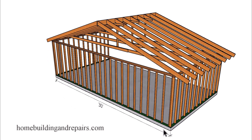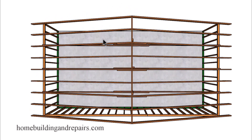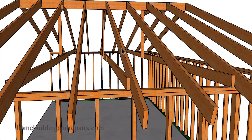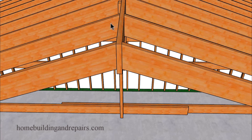What we have here is a 30-foot wide building with two-by-six rafter ties that lap in the middle. The rafter size is irrelevant here — you're going to have to check with your span charts, your engineers, local building authorities, and contractors to get that information. A 30-foot building can probably be built with larger roof rafters than two-by-eight or two-by-six. For those wondering how the roof rafters line up at the top and the rafter ties connect to the same side, I'm simply angling the rafter ties, and that's not going to be difficult to do in this long span.